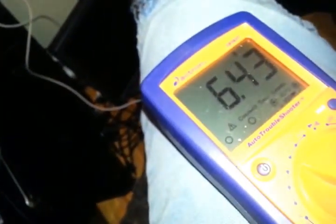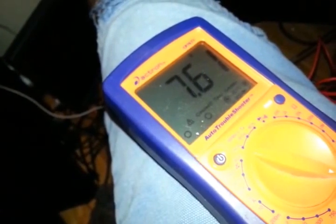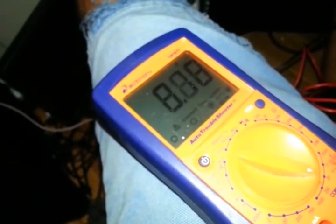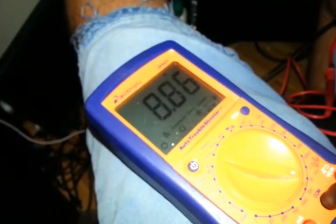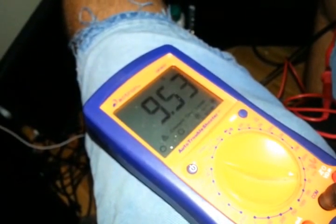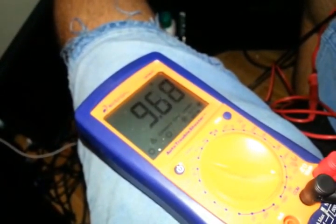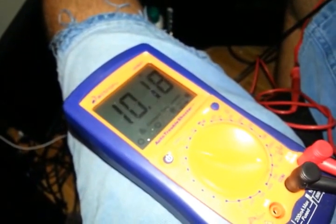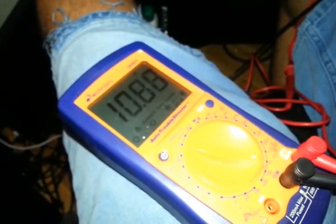It's probably been about five minutes, so I'm going to plug it back in at my outlet for another five minutes and see. I'm counting back up again. It says to do this until you get to above 20 volts. You're bypassing the smart circuit, which basically is telling the charger there's no battery here — the battery's not good and there's no need to charge it. So the charger will not output to the battery. You're bypassing that smart charger — which isn't very smart, obviously. You have to be smarter than it to get some voltage to go in. I mean, it's a brand new battery used one time and it won't work.